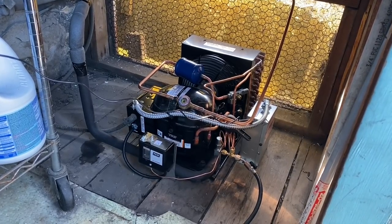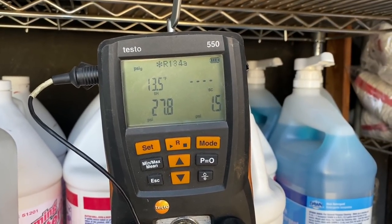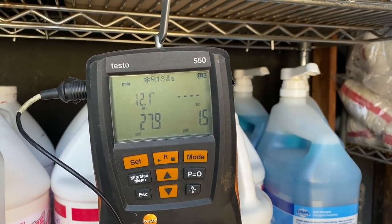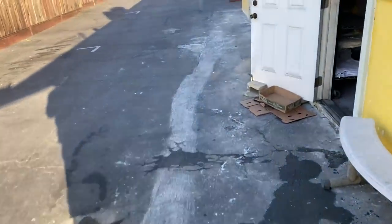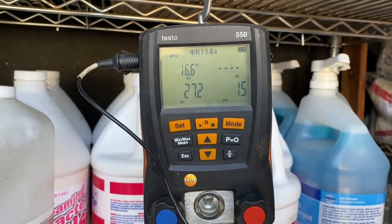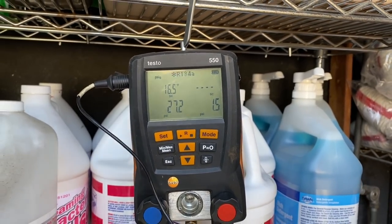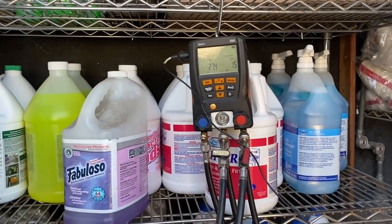The TXV is wide open because the box is hot, but at least the superheat's hanging in there a little bit. Because that box is so small... Now we're back up to 16.5. We're heading in the right direction, and it's stable now because that coil is clean. We're almost there. Might have to adjust the valve a little bit, but let's let it get closer to set point and see how we do.